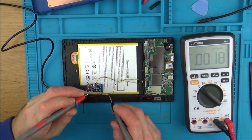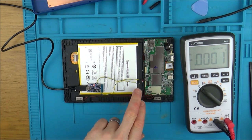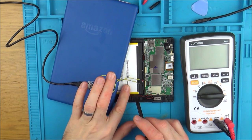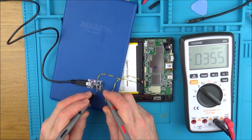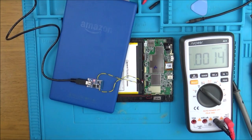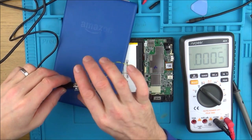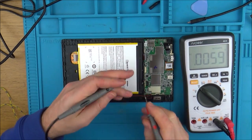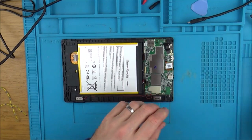I just thought it's probably not best to have the TP4056 directly on the battery because it gets a little warm, so I've put the plastic cover on. About 15 minutes have passed — it's measuring 3.95V, definitely more than before. I can feel the plugs are warm so it has been putting charge in. Now let me measure the battery standalone. It was 3.3V before — and now it's 3.7V. Excellent — let's pop it back in. I'm really hopeful now that might be enough.